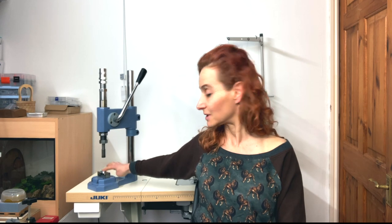The only other thing you will need to regulate is the die. The t-bar has the die slot here and you put the dies here. You will need an allen key for that — put it here, unscrew it first, then screw it back.